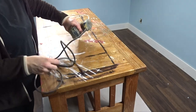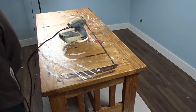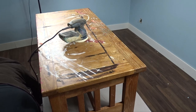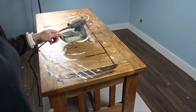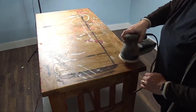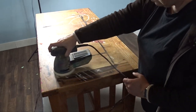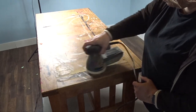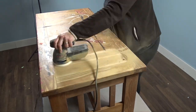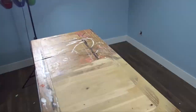As you can see, this coffee table is in pretty rough shape. Originally it was just raw wood — it's pine and it never had any stain on it. I did use it at one point as a crafting table, so it needed to get all that stuff off. I'm using an orbital sander with 100 grit paper. This did take a little while because once I was done with 100, I switched to 150 and then to 200.